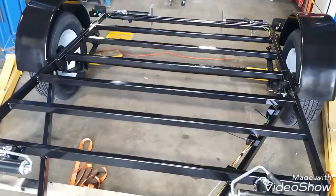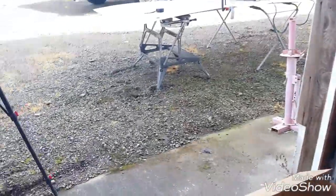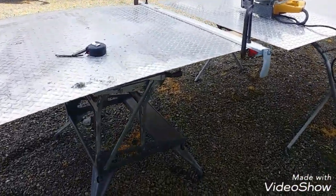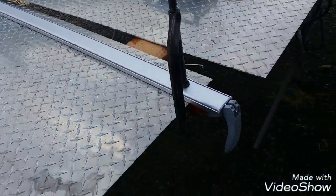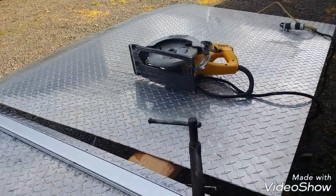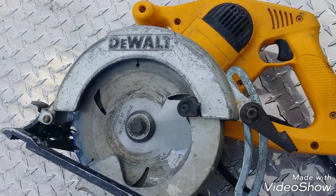As it rolls down the highway — that would be cool. So anyway, that's a cut in aluminum with a little skill saw. My tech tip would be to put something up directly underneath it — a sacrificial piece of wood next time — because it warped on me a little bit. But that's okay. Thanks for watching, commenting, subscribing, and we'll catch you on the next one.